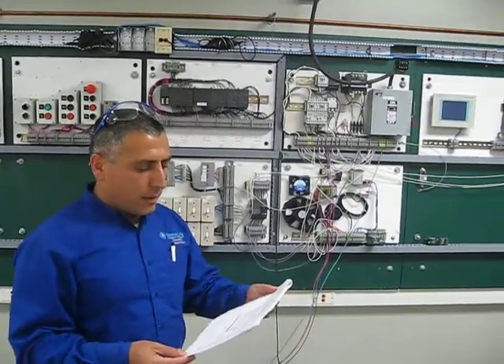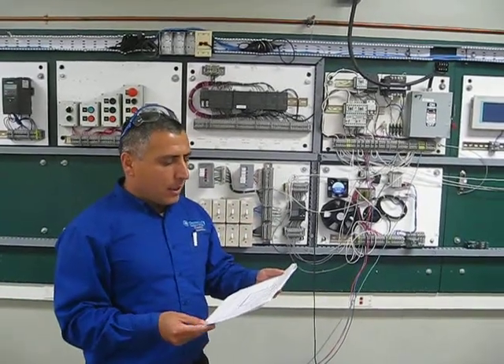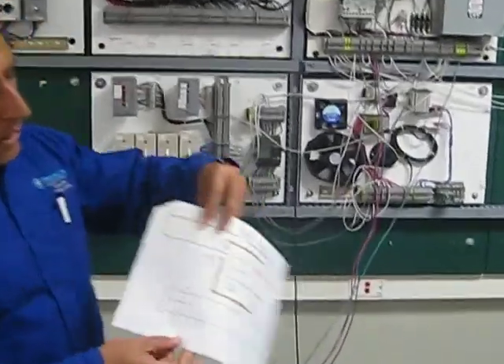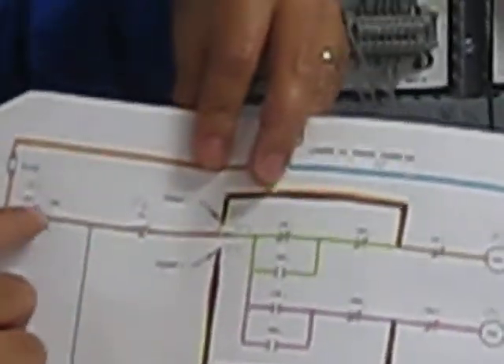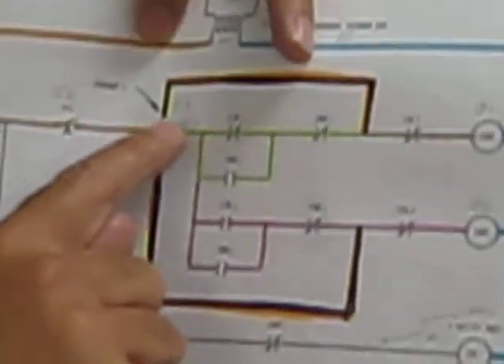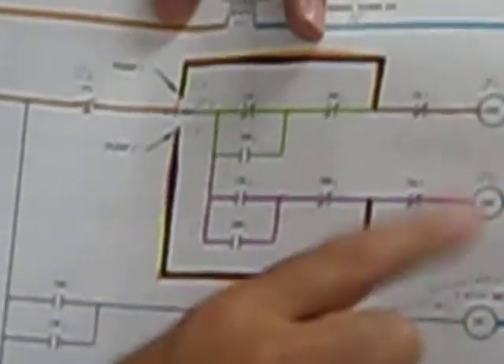Tonight we are going to be learning about how to start and stop three-phase motors using an auto/manual start and auto start with control from a pressure switch, and also an on/off for the system. We have an on/off to kill the whole system, or we have a pressure switch — when the pressure switch kicks in, we can choose path one which energizes pump number one, or path two which energizes pump number two.